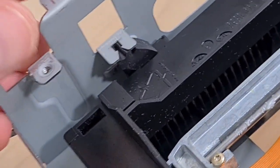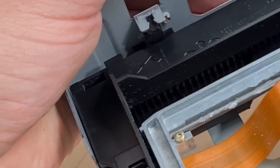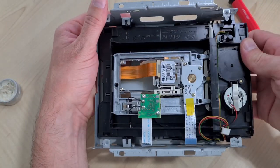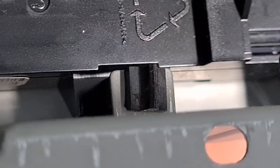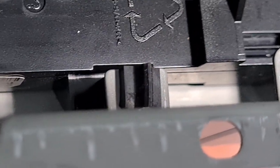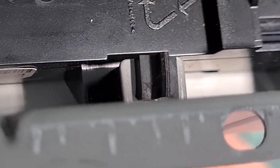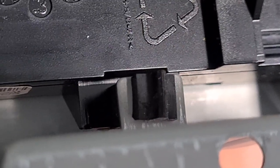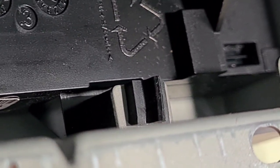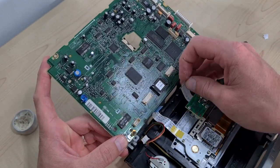Back in the cage now — you've got to force these rubber feet underneath the bits to allow them to click into place. It just floats on those rubber feet. We can reconnect our chipboard and put it back. Just double-check that when you put the feet back in they don't sit underneath the silver tabs — they sit on top, there's a little notch cut out for you to slide the silver tabs into the feet. I'll also show you my issues: I put this back together and the drive door wasn't aligned, so make sure they're oriented correctly.